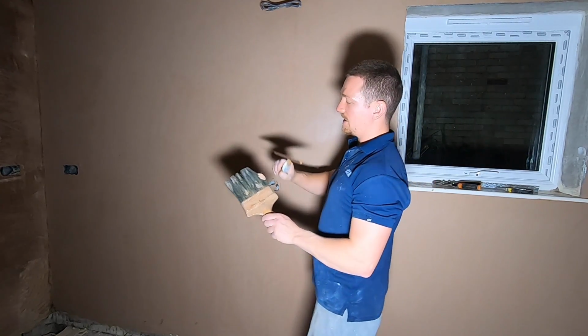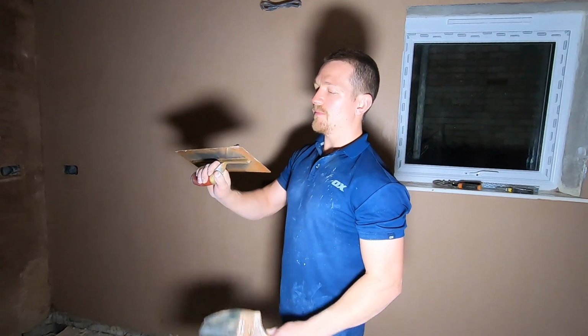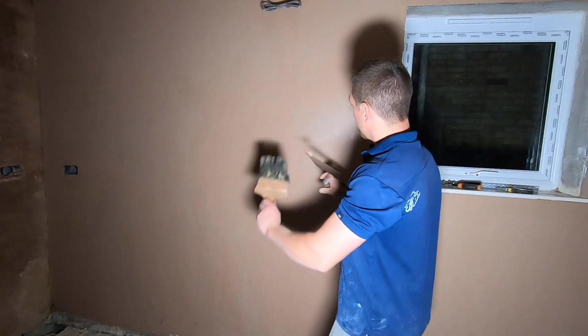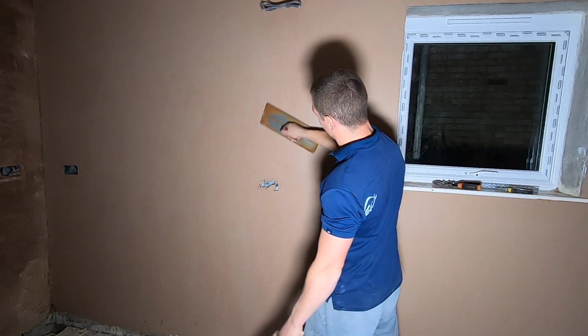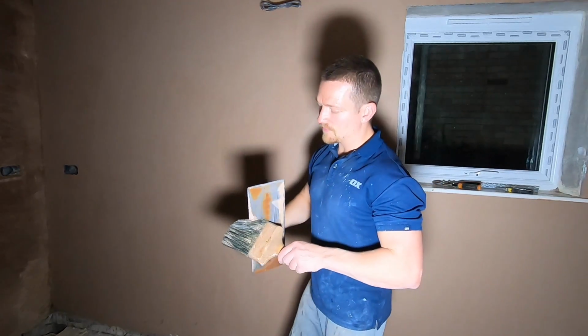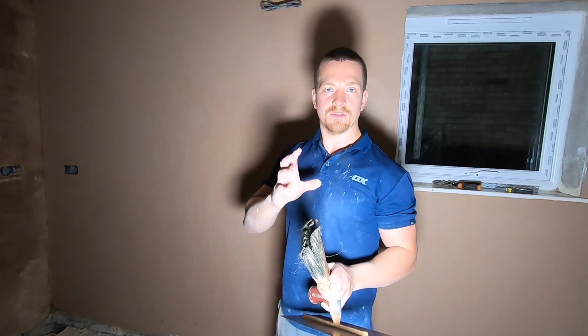What you'll do is you'll collect fat. This is excess plaster that we're taking when we're ruling it off. When we're troweling it from the plaster, that's excess. If you've got any gaps or anything, put the fat on the wall, fill it in, and trowel it back into itself. This is the stuff we use when we've got holes or dinks. Fill it with the plaster you've just pulled off the wall.